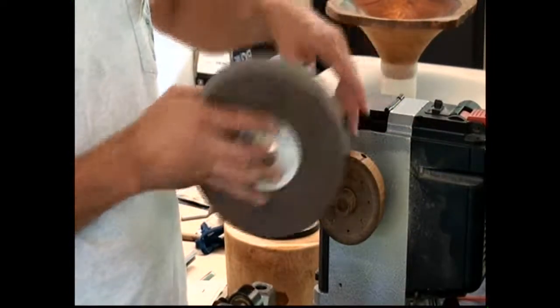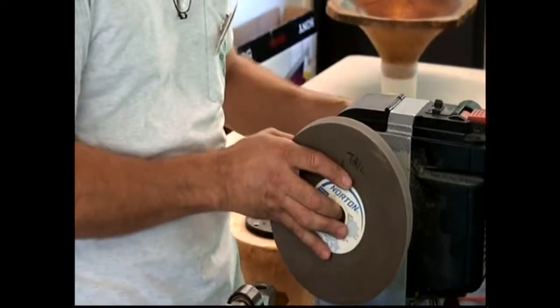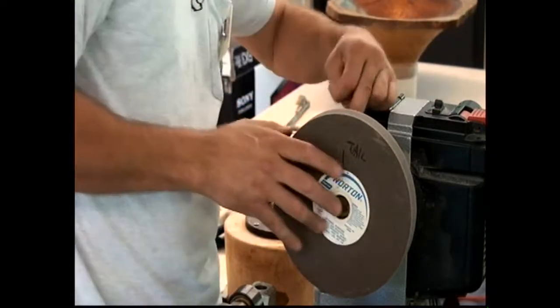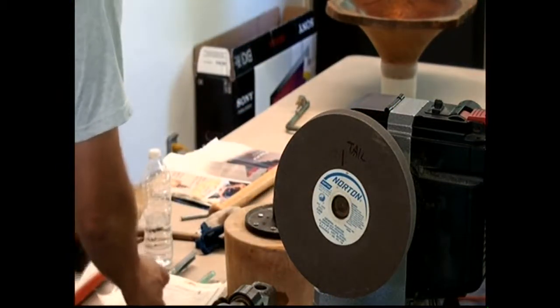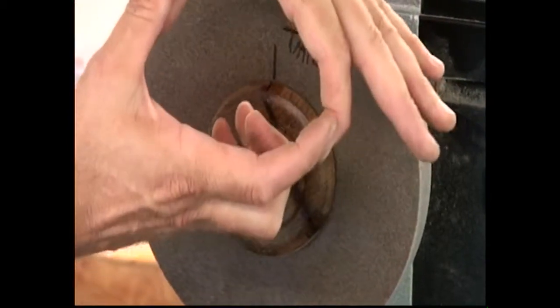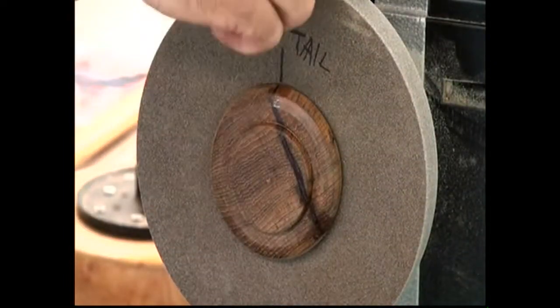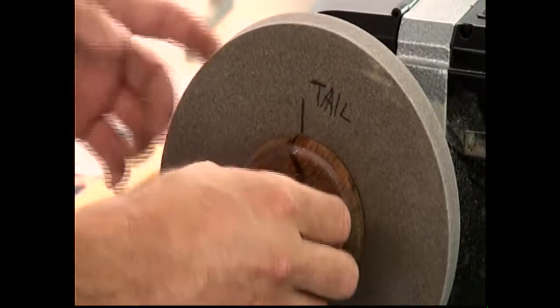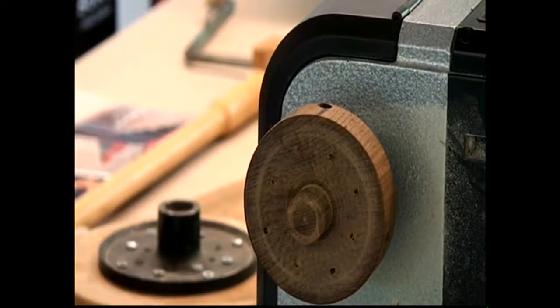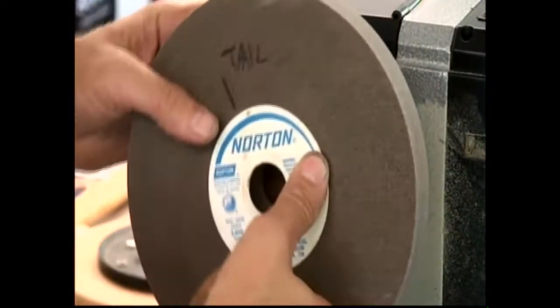This was on, I did this one on the Jet Mini lathe in my studio. So this may wobble a little, maybe different. I turned it on and it looked to be running pretty true. I'm just going to line up the lines here. And on this side, I made a line too, and this is just held in place by the center. The one I made for my Carbatec, it was a smaller wheel because on the Carbatec I can only turn 6 inches in diameter. So I actually epoxied the wheel to both pieces of wood. But this way, I figured I can take this off, put it back in the box, and the wheel's protected. I'm not worried about trying to get this thing unscrewed.